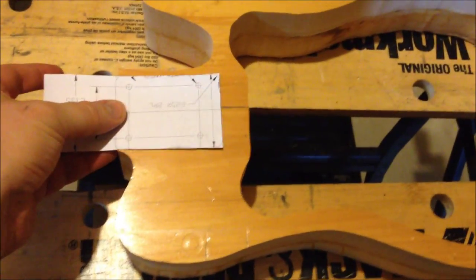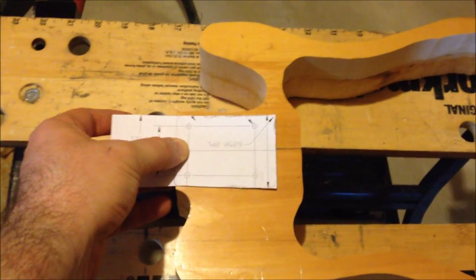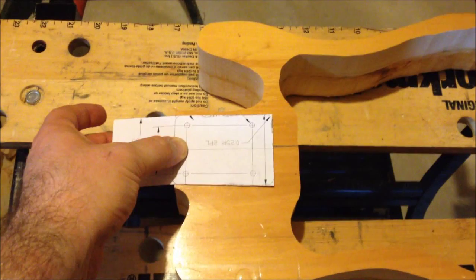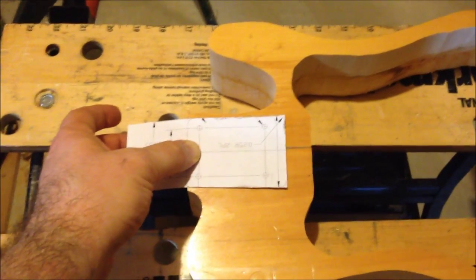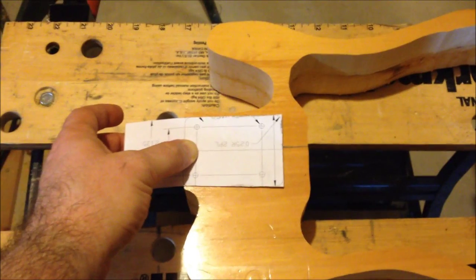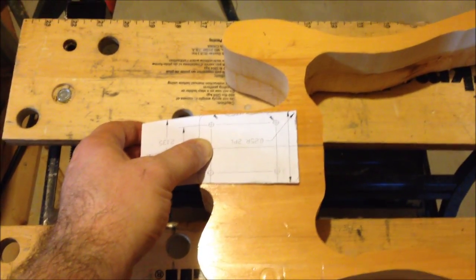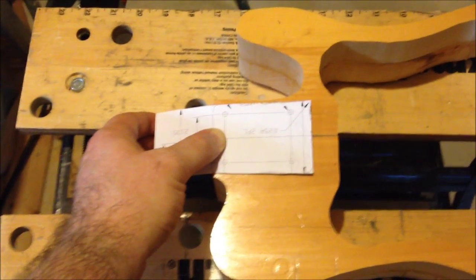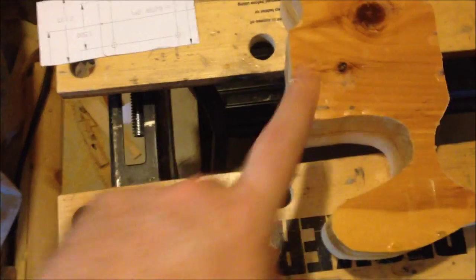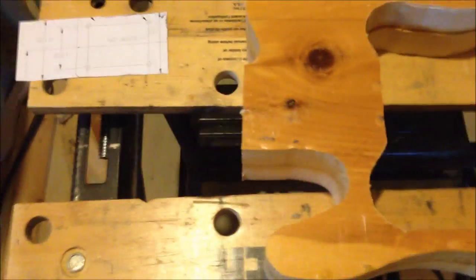We've got the body ready to go — I've marked a center line. Now I just have to cut out that shape. I cut this out to make measurements when I was making the template, but I actually want the other piece — the exterior — so I can route inside the lines rather than trying to route off the pattern. That seems to work better for me. I have to be careful because I don't have a lot of surface to balance the router on, so this requires care and attention. I'm going to figure out the depth I need from the old mini Strat body and the thickness I need from the same, then route a larger pocket so I don't have a great big fat chunk of wood behind the neck that I've got to get my hand around.